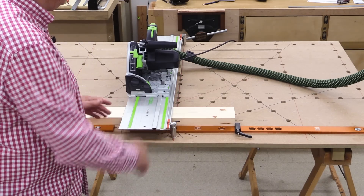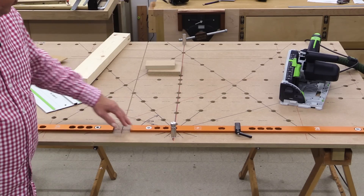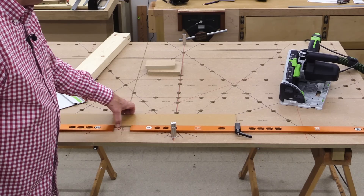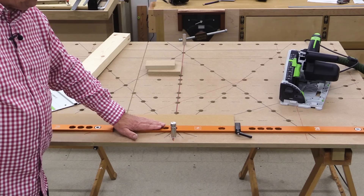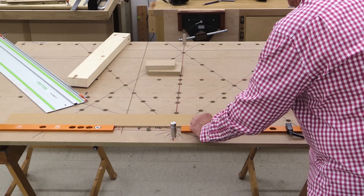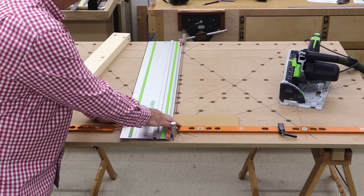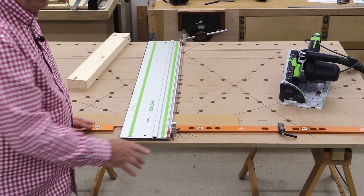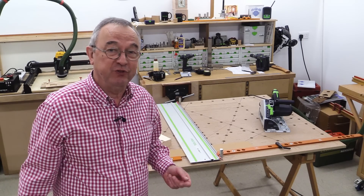Now let me just talk about positioning the fences themselves. The way I've got it set up now was fine for thick stock. The UJK Parf system fences are 10 millimetres thick, and if you want to cut thin stock — like this piece of hardboard here — you really need to allow the track to go down onto that surface, but the fence is just slightly too thick. Well, the remedy is very simple: all you do is move the fence so it's out of the way of the track. The fence is there, and we can now put the track in position — the fence on either side is not interfering with the track sitting down on that narrow stock. I like to have two fences on my track saw cutting station, one for each side, and they stay there all the time. And of course you can use these new fences for 45-degree cuts as well.